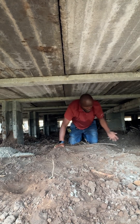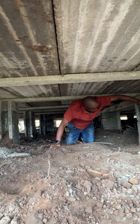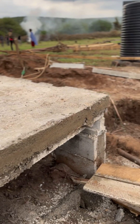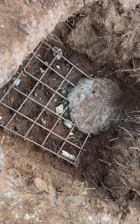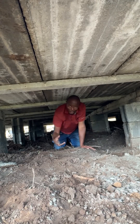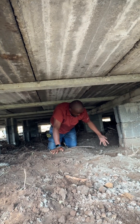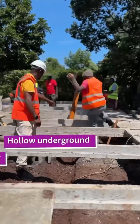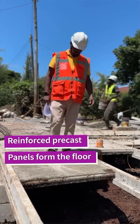You get cracking issues. In our case, we are using the midsection piers as mini columns going all the way to the SBC — we identified our SBC at barely 1.2 meters. We introduced a footing which is 1 meter square reinforced, and the pier section goes below the cotton soil. We excavated the cotton soil exactly to the pier section, grew our pier, and then installed the pre-stress T-beam at the platform floor. There is also a 50mm concrete floor reinforced with fiber mesh.